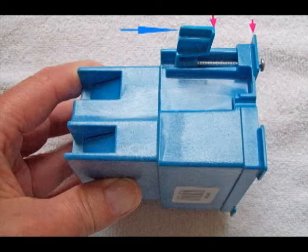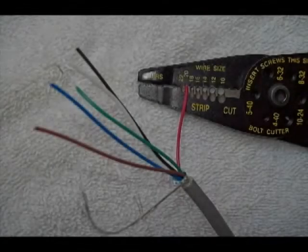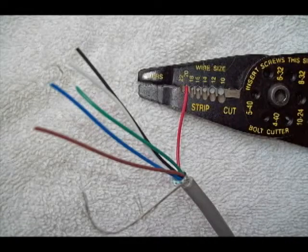Adjust the flip-out wing shown by the blue arrow to a little bit more than the width of your drywall, the width being between the two red arrows. After you've installed the wire in the walls where you need it, leave about two feet hanging out each opening for the RCA plate. Carefully cut and remove the gray outer covering on this cable, then tear away the tinfoil, leaving only what you see here in this photo.